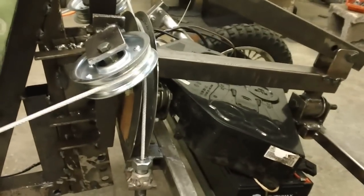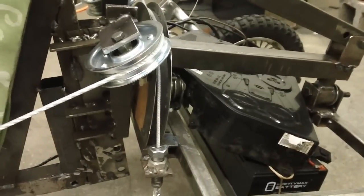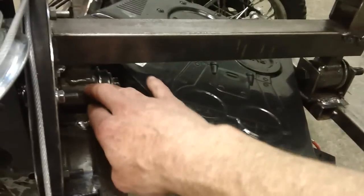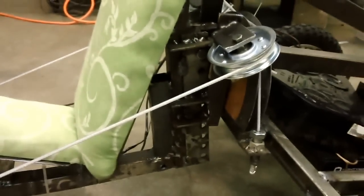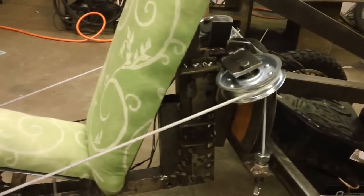This is 14 degrees on the lean machine, and on the Carver, their patents say that the angle is at 7 degrees. So this is quite a hefty angle. So here's my bearing pivot points right here. I've got them on car bushings, and so that's my axis. You look at that, you would think, man, are we even above the center of gravity? But we are. But it makes for a light tilt.